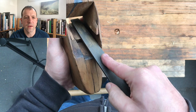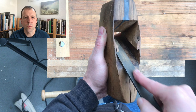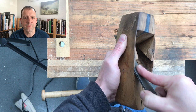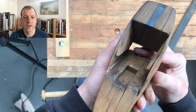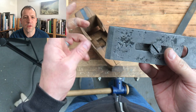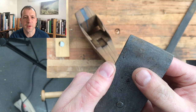Now comes re-bedding the throat and flattening it. You want consistent contact between the iron at the top of the throat and at the bottom right at the mouth — no high spots in between. The iron can make contact in between the top of the throat and the mouth, but it has to be consistent all the way across. In old planes like this it very rarely is, and if you don't get that completely flat you get chatter, which really screws up your planing. If the epoxy on the cheeks holds, then all the components — the wedge, iron, chip breaker, and the plane itself — should hold steady.